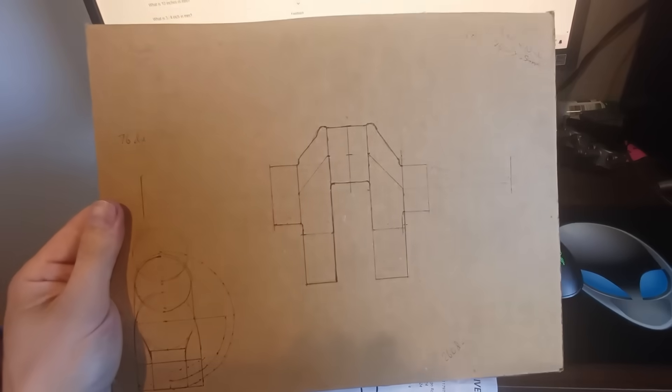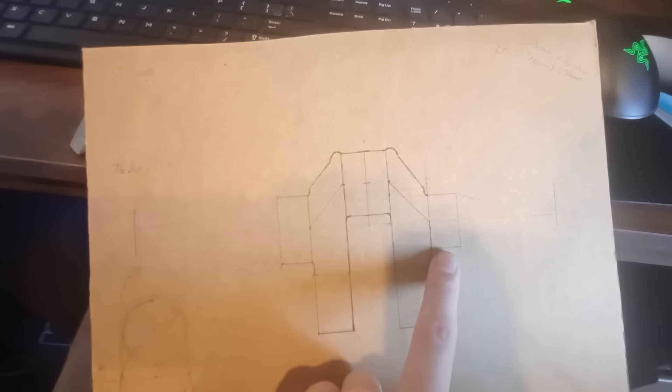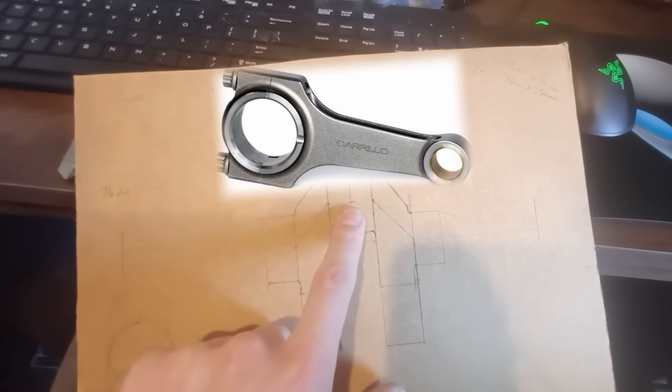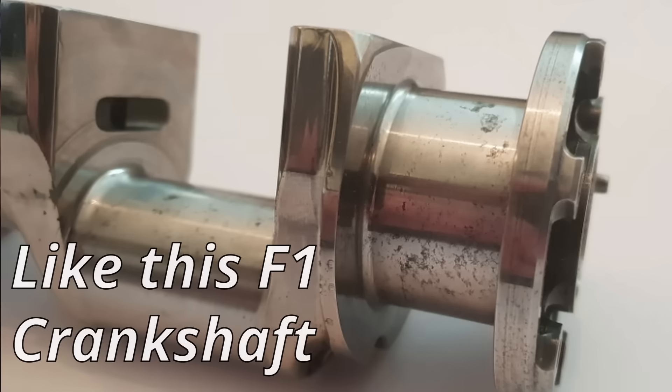While that investment is curing, I thought I'd show you another part of the project which is the crankshaft. I did some CAD a while ago on the cranks - it's actually a cardboard aided design. I had a crankshaft and I just took a whole bunch of measurements off it because essentially I'm combining two different cranks. The outsides will still be roller bearings like the FXR crank with the same drive and taper, but the middle section will have a plain bearing to take the R6 rod and piston. I'm planning on making the counterweights removable.